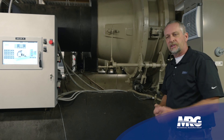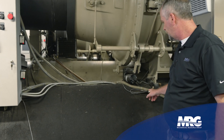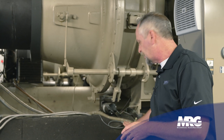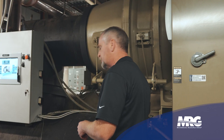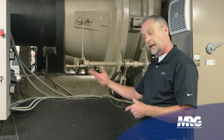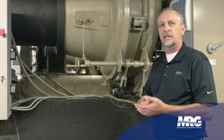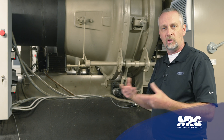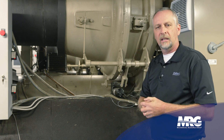A few components that come with the package: a new inlet guide vane actuator and the transducers I mentioned. These are dedicated low-pressure transducers because we're putting it on a low-pressure machine — they'll send you sensors and transducers applicable to your specific machine. All new sensors and cabling, which is well marked and labeled. Just remember what device you're replacing when you wire it back up. Spend a little extra time labeling on the front end and the end of the job will go really smooth.